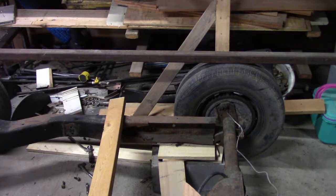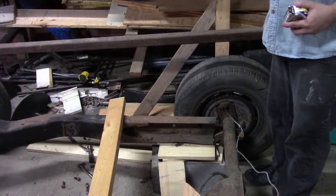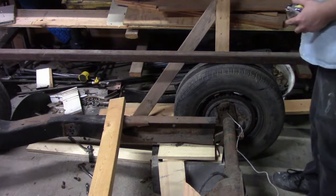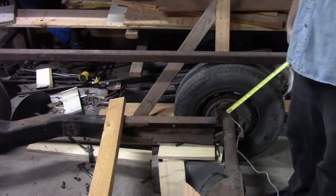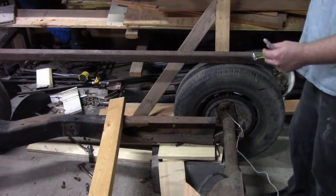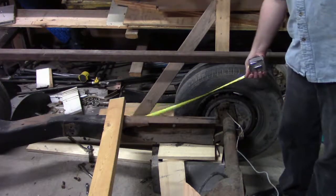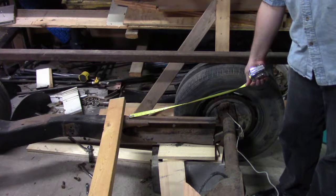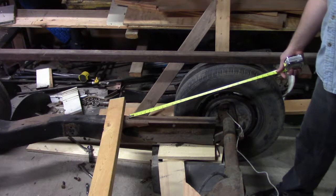All right, our first step is we got this piece of square tube. It's a 2-inch by 1/4-inch thick. And we're gonna use that to extend our frame out, so we got a place to attach the back section. So I figured that from about this frame cut here from the factory, it's a good place to measure from both sides since it should be about the same.